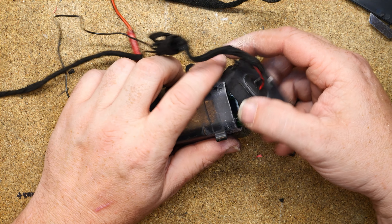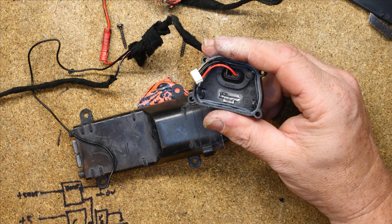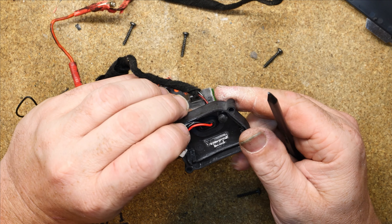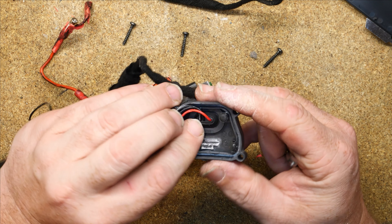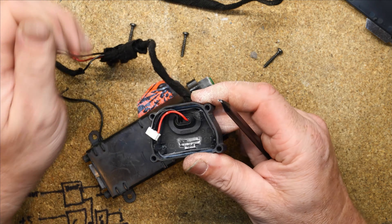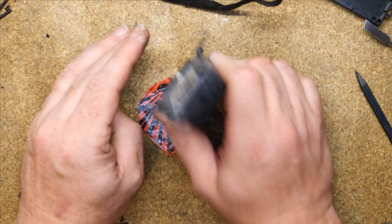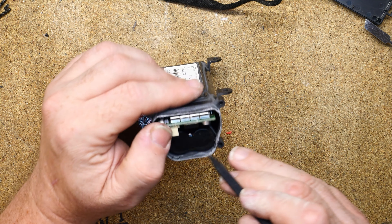That feels like that wire changes gauge in there. We're not potted - we have a connector on the end here. So we have a four-way connector here and that looks like a rubber bung for something like a SIM slot, but there's no sign of it. There's all sorts of little pokey through-type bits that don't go anywhere. That grommet looks like it's actually removable, and we've got another one there for something that quite obviously is not fitted - so that's obviously changed design over time. There's a battery in here. Most trackers do have a form of battery backup.